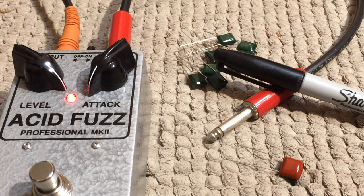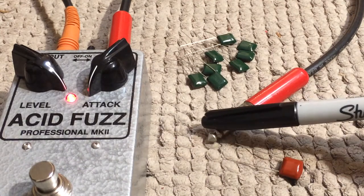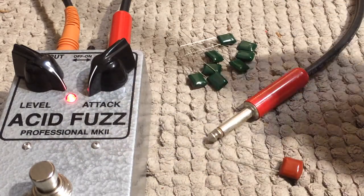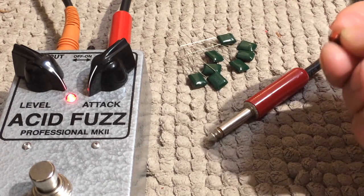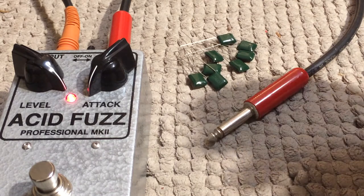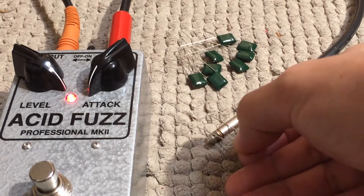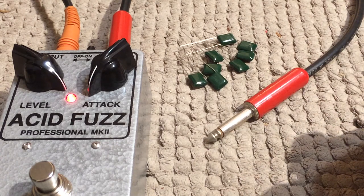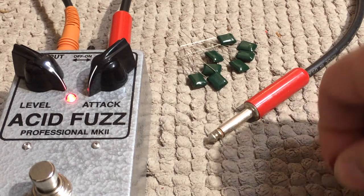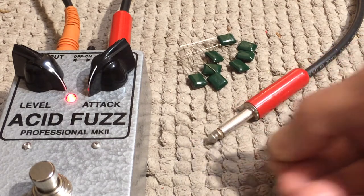You can easily check the polarity of your film capacitors by taking a fuzz pedal, plugging it into your amp, and leaving the input jack disconnected. You don't even need the fuzz pedal — I just use it because it bumps up the gain and makes it easier to hear things without cranking the amp. Just touch one lead of your film capacitor to the tip and the other lead to the shield. The human body will induce roughly a 60-cycle hum. If it's hooked up backwards you'll definitely hear that hum; hooked up with correct polarization it'll be much quieter — pretty much dead quiet.